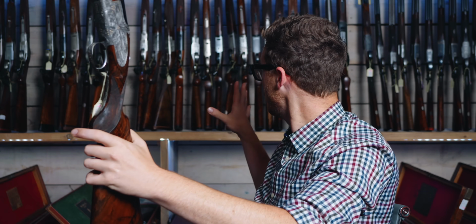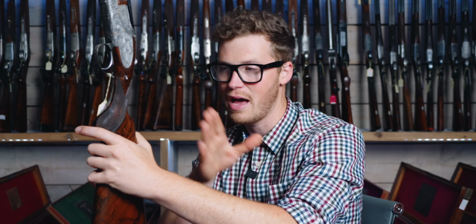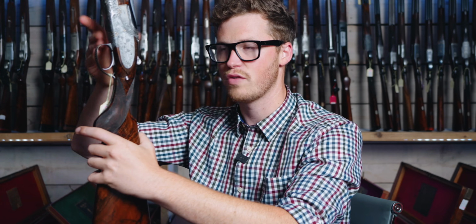You can look around this wood and pick many of the finest gun makers in the world, and most of them will have relatively straight, relatively unexciting woodwork. And that is because that is the strongest. Not only is it the strongest, generally speaking, if it's that consistent, the shrinkage and deformation over time will be similar across the grain of guns. You're looking at a much longer lifespan without it looking weird, shrinking on the left, warping to the right.